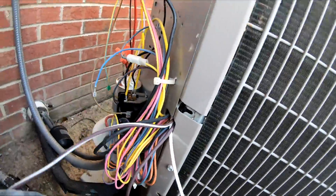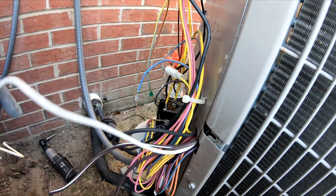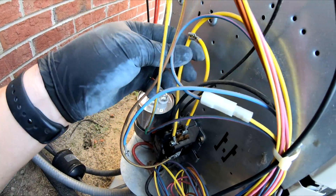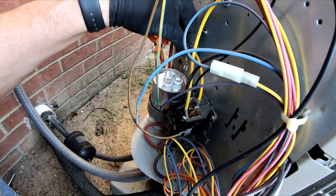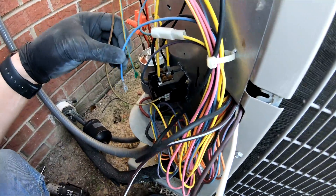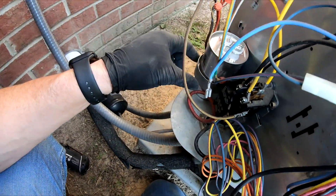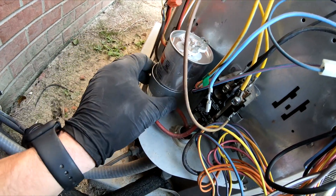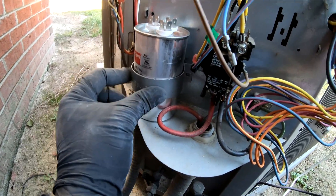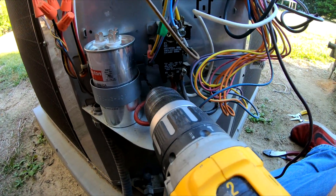The brown and white — snip the end off and put some tape over it, tape it out of the way. Our white wire basically replaces our yellow and goes to the cap. The yellow is already going over to the cap. The brown wire goes over to the fan. The blue wire goes to the herm. My bracket wasn't going to work very well on that side, so I'm going to drill a new hole and put my bracket over here. The cap is going to sit down here on the bottom — it's going to be fantastic.